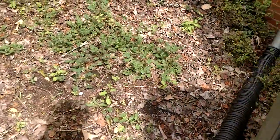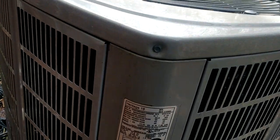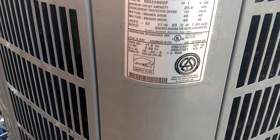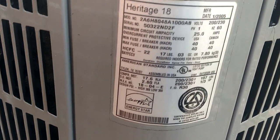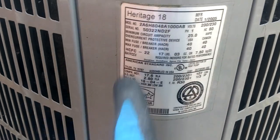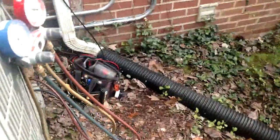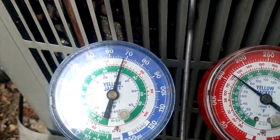The customer actually has doors and windows open - one of those guys who doesn't really run the air conditioner much. He did have the heat on so it was kind of hot in the house, probably up to about 72 in there now. This unit doesn't give me a set subcooling target because it's two-speed and variable - you have to look at the chart, use the bar graphs, and calculate your formula. There's no set 10-degree subcooling on this one. We've got 17 pounds of R-22 liquid gold in there - hope it never springs a leak, because adding 17 pounds back into this monster would be painful.